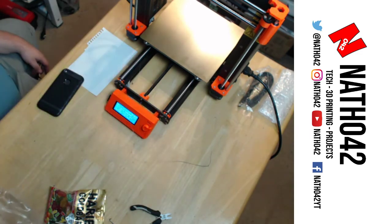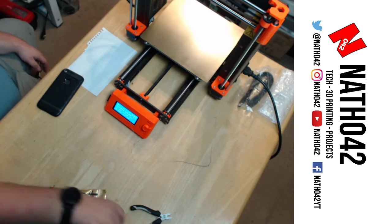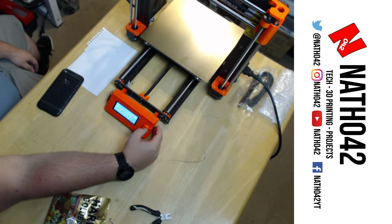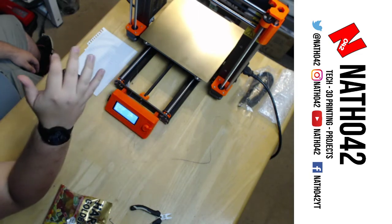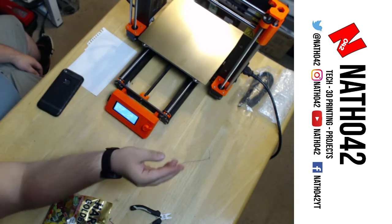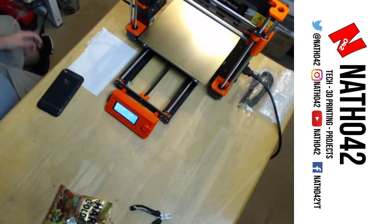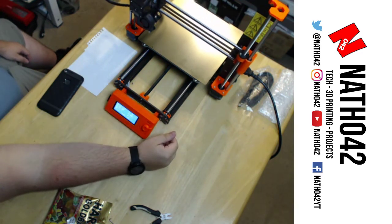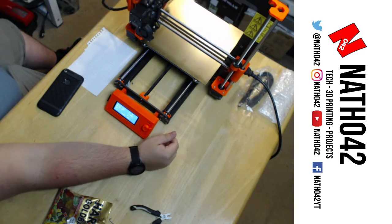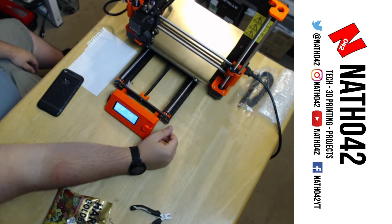Okay, here we go. Now, oh my god. Oh my god, please tell me this is actually a thing. Now I will calibrate distance between tip of the nozzle and heat bed surface. I will start to print line and you will gradually lower the nozzle by rotating the knob until you reach optimal height. Check the pictures in our handbook in chapter calibration. Oh my god. As if this is actually a thing. This is going to be revolutionary if this is actually a thing. I'm so excited. I'm so excited. God damn. Hello? There we go. Okay. Maybe.